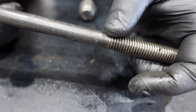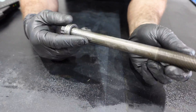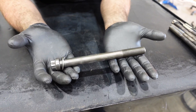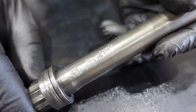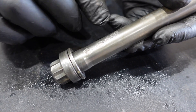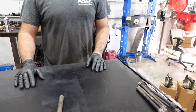This one also exhibited corrosion, so we replaced it too. Now, this one came out of a K-Series Cummins, six-and-a-quarter bore — an eight-inch zinc phosphate coated bolt. There are many different types of K-Series head bolts; this is one of the more common ones. This one is acceptable: you have less than 1,000th depth of corrosion and the affected area is within spec, so we're okay to reuse this head bolt. These are also very expensive, so we try to save the customer money whenever we can.